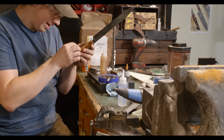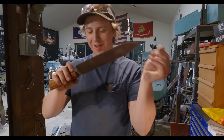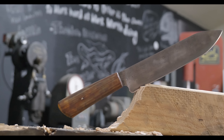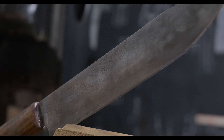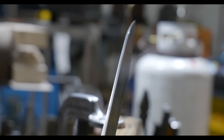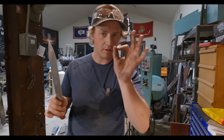This is the ugliest knife. It looks really bad. The handle is finished to a lovely 120 grit, there's a massive amount of black epoxy up at the top, it's at a 120 grit belt finish on the blade with some scotch brite on there for classiness, and a little bit of etching just to show that it's pattern welded. But we're going to destroy it, so it doesn't really matter. I'm going to make sure it'll go through the rope at least three times and then go through the two by four three or four times.